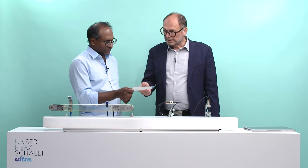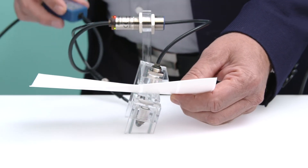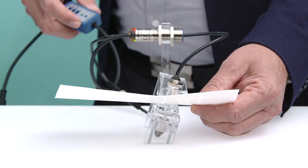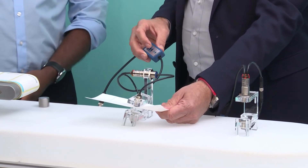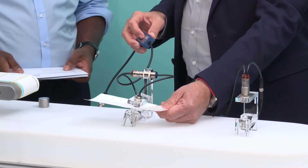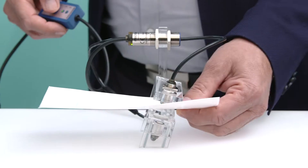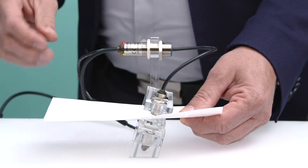We have a label here. The ESP is set up in label mode and QuickTeach. It's really very easy. I put the label inside the barrier. I choose here my controls only to give different signals on the control input line. I give high level on input line C1. This enables the teach-in procedure, and I take the signal back — the teach-in is already finished.